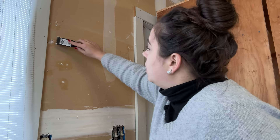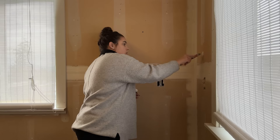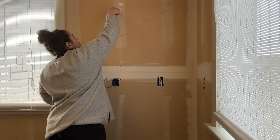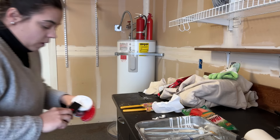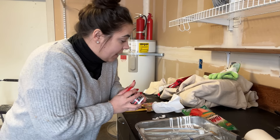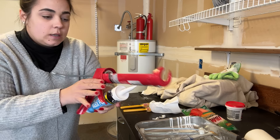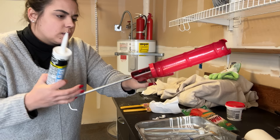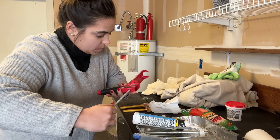I'll need to sand this after it dries. I think I've gotten all the holes — I may have missed one or two. What I'm going to do next is get some caulk on and around the two windows and the two door frames so that when I paint it'll give a nice, cleaner finish. I've never used this particular caulk before. If you've never used a caulk gun, there's a tube cut tip remover with a little knife on it — you put your tube of caulk in at an angle and cut it.